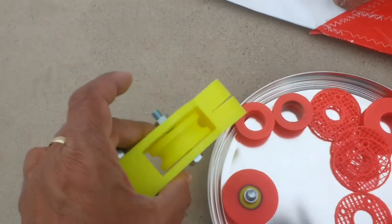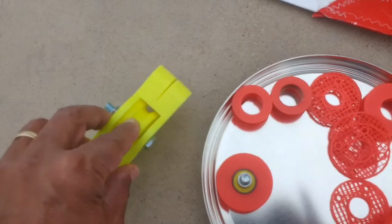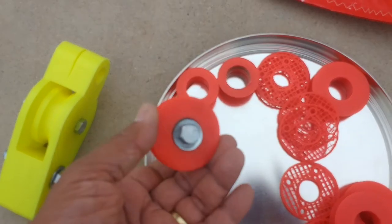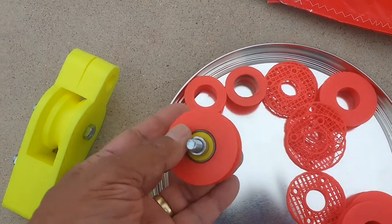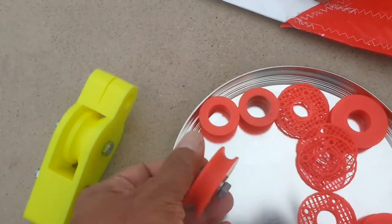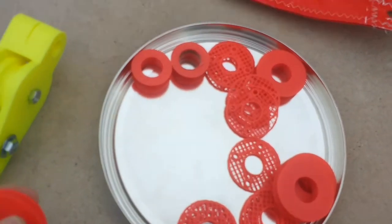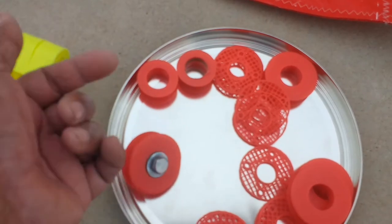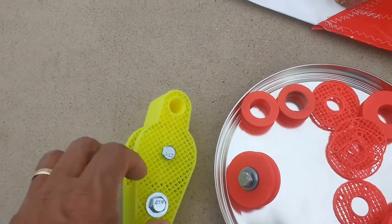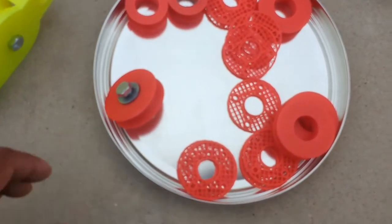I installed two standard skateboard bearings in the new design. I can use standard 5/16 bolt hardware. I did order a set of pulleys, but while I wait for them I decided to just crank these out. All I need are the brackets — the plates that are going to support the pulleys. I'm going to do the plates in eighth-inch thick fiberglass and CNC cut a bunch of them quickly, and I'll have my pulleys.